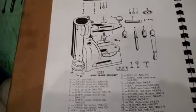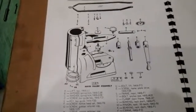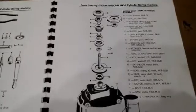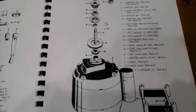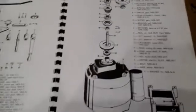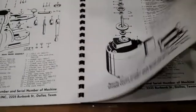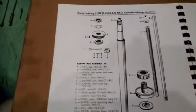You then see two sets of cutter heads — there's a finished set and a fine set, and they're for short and long depending upon the bore that you're doing. There are spare cutter bits, and then there are two fixtures for sharpening the cutter bits. We have the large clamp, and next to that you see there are really three sets of centering jaws.